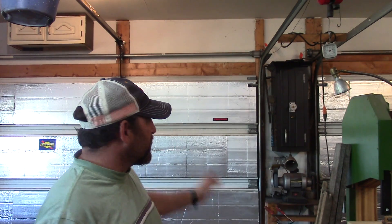I'm really impressed with how cold it is. My garage is about 600 square feet with nine-foot ceilings, and I'm insulated very well including the garage doors - I recently put up two-inch foam board because last winter was so cold. This 18,000 BTU unit is more than enough; they actually recommended the 12,000 BTU, but I oversized it. If you have any questions on these heat pumps or mini splits, put it in the comments and I'll be happy to answer. I'll link to all the tools I used for this project, and I'm going to make a follow-up video on how this unit's treating me. Thanks, guys.